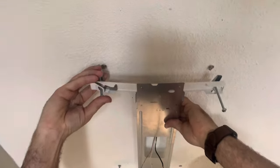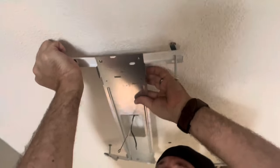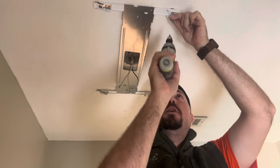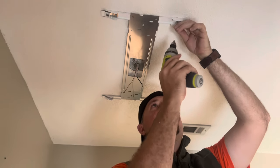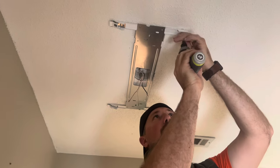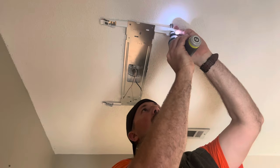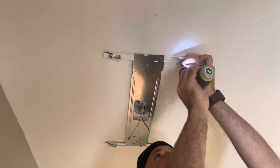I'll show you one more right here. You're going to pinch it, push it up through that hole, and then we'll go ahead and hang. We'll get all these set and then we'll screw them in. With these toggle bolts, if you just try to turn with a little screwdriver, you're not going to have a lot of luck. You have to create some downward pressure so that wing is pulling against the ceiling. You can do that by holding your screw or pulling down on the bracket — as long as there's a little pressure on it — and then it'll pull itself right up there until we're tight.